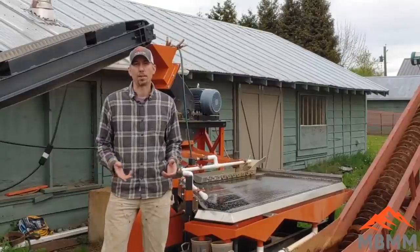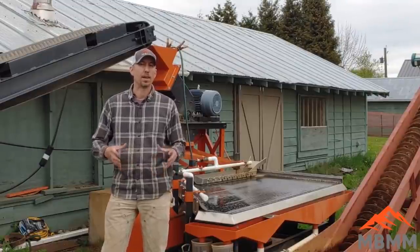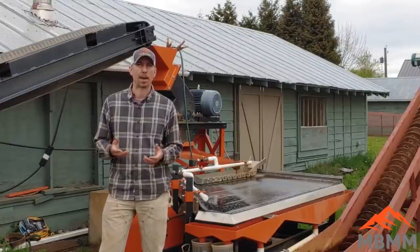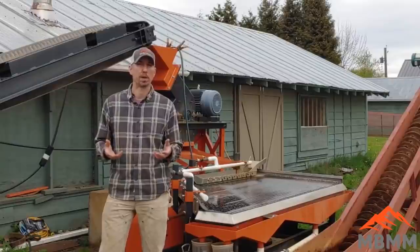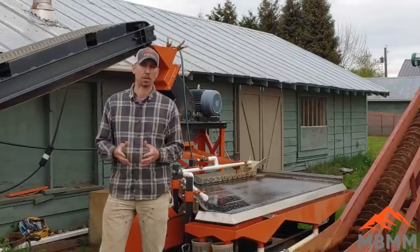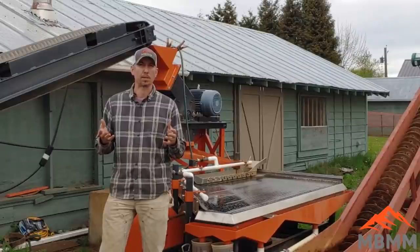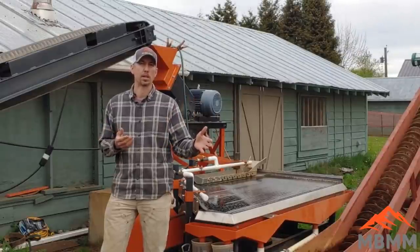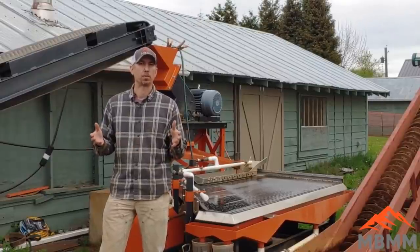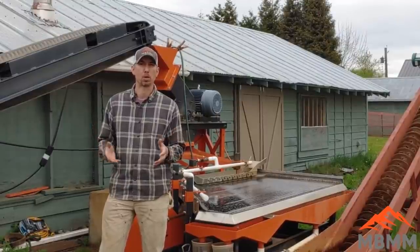So we covered a lot of ground, and we looked at all the details on our recovery and our grind size and all that stuff. Now I wanted to pull back and look at some of the bigger picture, and do kind of a rough back of the napkin analysis of what we could expect if we implemented the system up near the dump pile on this claim. So we're recovering about 75%, plus or minus, and with 20 grams a ton in the ore, that means we're recovering about 15 grams a ton. For an operation standpoint, you figure you can run 6 hours a day. That's 6 tons, that's about 90 grams of gold.